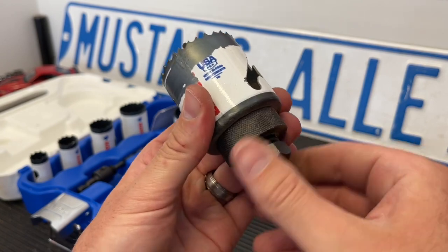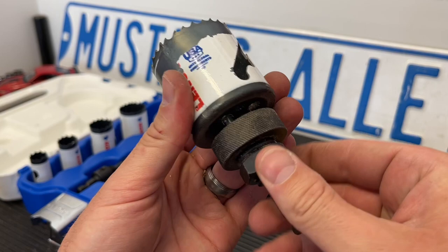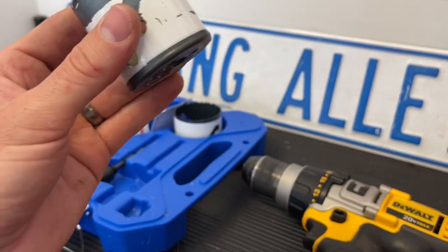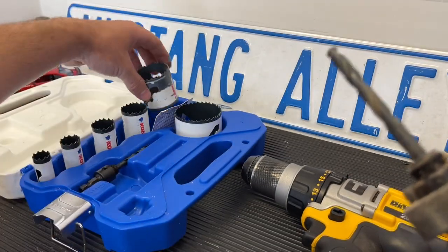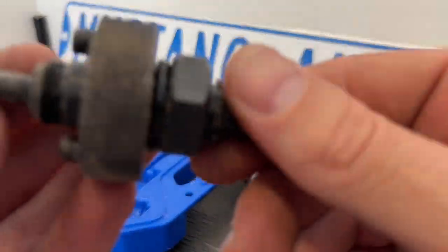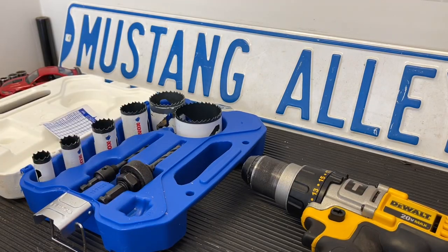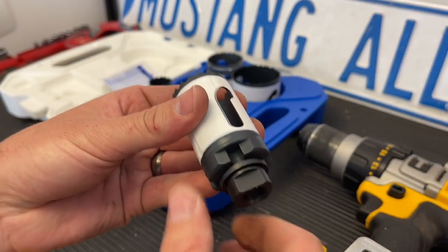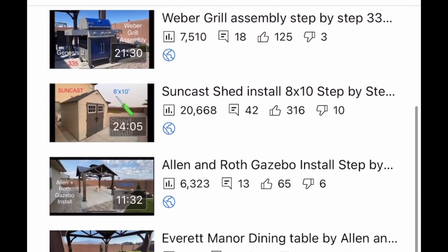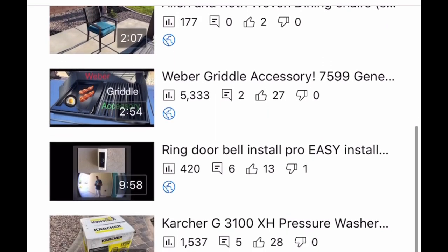To disassemble, loosen up the jam nut, then pull the piece down and out, and unthread the bit from it. That's as easy as it is to use one of these — it comes in very handy if you want to drill a nice hole into something. So that's what the chuck looks like and what this kit is. Thanks for watching, hopefully you enjoyed the video. Please check the video description where I'll put links to purchase these, and also links to other similar videos I've made.